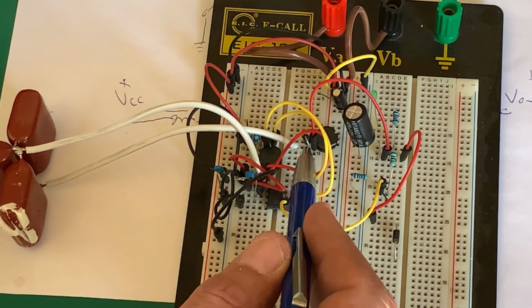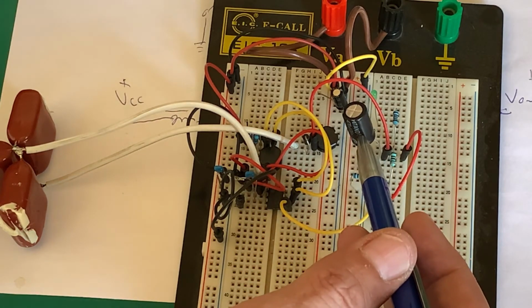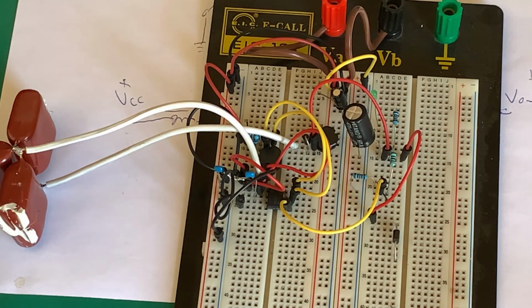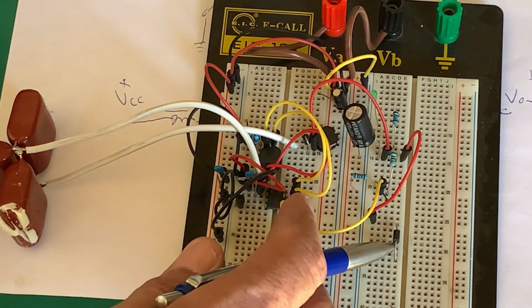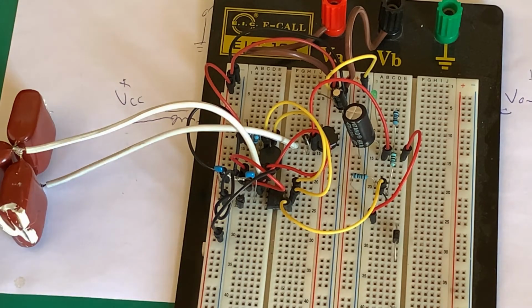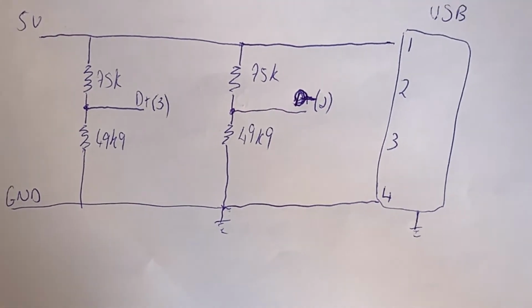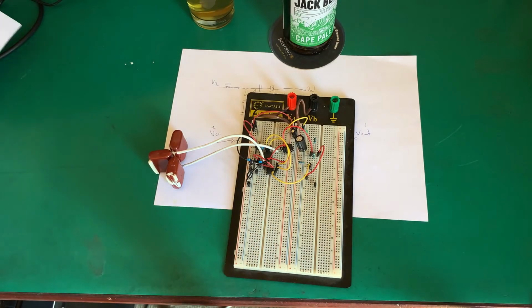That over there is our little rectification diode, our output filter capacitor, our input filter capacitor. Nothing fancy down here. We just have our blocking diode. That's still a 1N5819. I'm going to change that to 1N4007. And down here we will put in that circuit a bit later on once we're happy with everything. So not really much to the circuit.